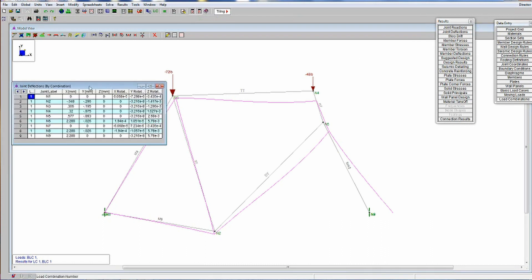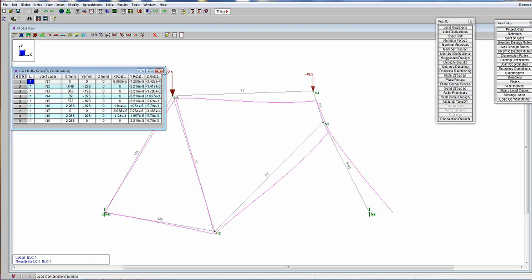How much is it? If we look at node four — that's kind of where your stem is mounted to the bike — node four displaces about a millimeter. So not a lot, and this is just with Miss Cool sitting on it. But what does one millimeter mean? Can you even feel a millimeter? To put it in context: a bicycle tire that is inflated will deflect between four and five millimeters depending on air pressure and weight. So this frame is deflecting one millimeter — about a quarter of the tire deflection. So it's not as much as a tire, but it's actually more than I would have expected. And I'm sure if we stiffened it up with a really rigid fork, you would definitely feel the difference.